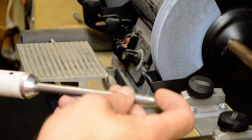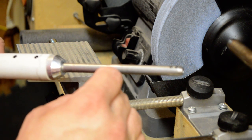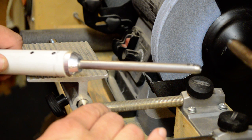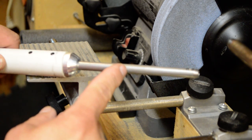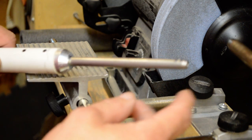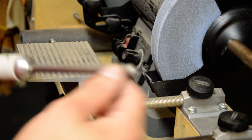Start bending it slow; keep it there. If you need to add more heat, add more heat as you're bending. You don't want to bend it to the point of breaking. If it turns blue on the bend, don't worry — it's not going to weaken it enough to break. For 3/8 inch, the MAP gas torch won't heat it enough to bend, so I stick it down in the burn pile fire about four to six inches, leave it until it's glowing orange, grab it with vise grips wearing leather gloves, run into the shop, put it in the vise and bend it. Don't forget the sacrificial bit — you'll squish it closed and have to make a new one.